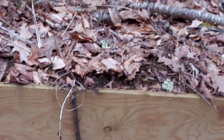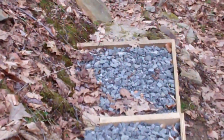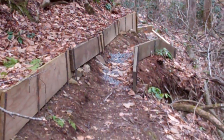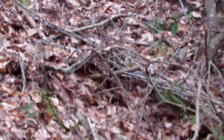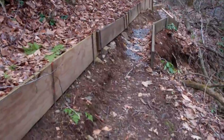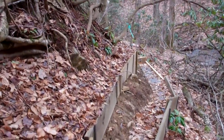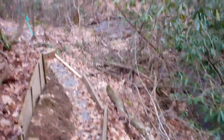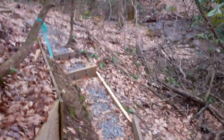Here's another spot with a dip where I built a retaining wall — treated plywood and two-bys, 5/8 rebar. Some more steps just for ease of working or walking, all four seasons, with a lot of rain and snow. There was a spot with some nice big tree roots I didn't want to disturb, so I built a retaining wall — another retaining wall just to keep from falling down the hill. I could have gone up over that hogback, but then I'd have a high spot, and you don't want a high spot in your penstock. I want to keep it on a constant downhill angle. It's steep — especially when you're working on it and it's wet and you're sliding down the hill — the retaining wall became very helpful.